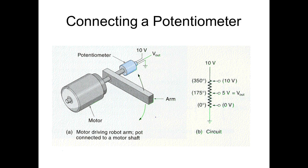So rotary actuators are usually rated in degrees. Linear actuators are rated in units. Like a linear actuator might have a 6-inch stroke. That means it could go all the way from zero out to 6 inches, or what we determine as zero. There are very few linear actuators that actually pull their rod in completely. A rotary actuator has no stroke, which means what? It can spin.